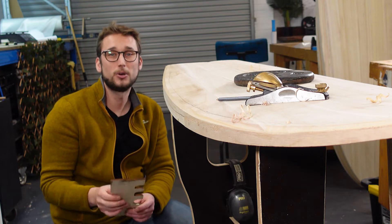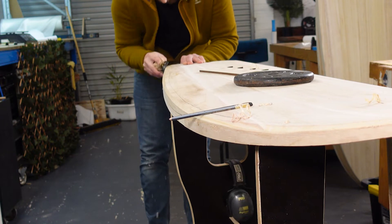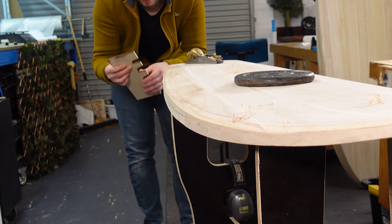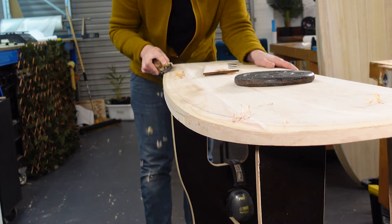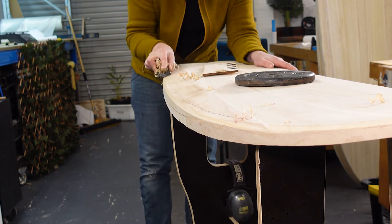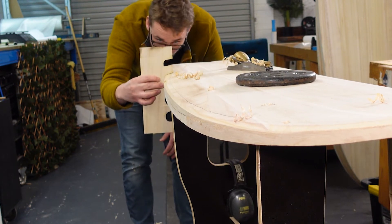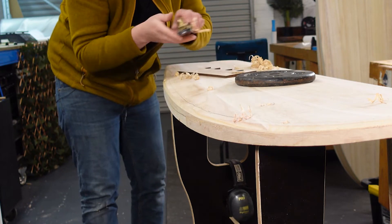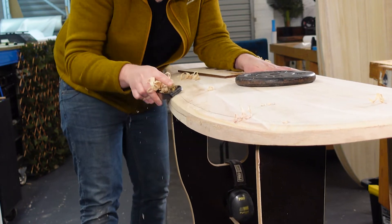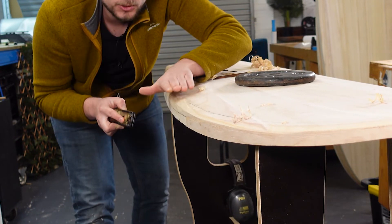At this stage it's okay to take shorter strokes in these specific areas, but do leave some extra material before taking it to the final profile as we are going to need to tidy this up with some long continuous strokes to make it a consistent rail. What we're doing here is taking those newly defined edges from our chamfer and working them into the required radius. As I'm working this I'm also only working up to the line that we scribed on the deck and not taking it any further.